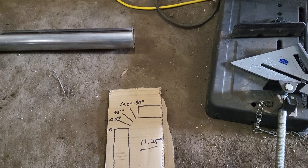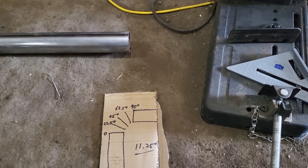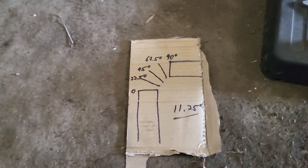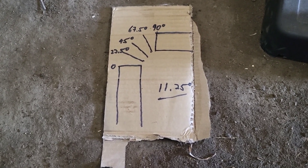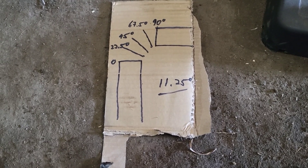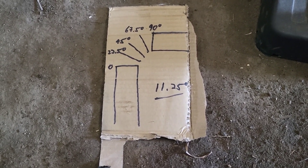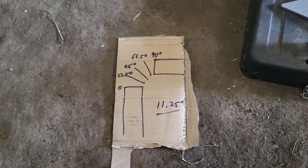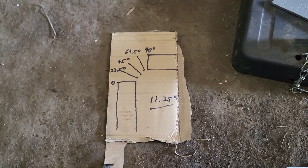I did get this from a video that Finnegan put out at some point. Initially you have to do some calculating. I want to get to a 90 degree bend, and I'd also like to easily do a 45. The best way to do that is with four pieces — two pieces gives you 45 degrees and four pieces gives you 90. There are cases where guys TIG welding turbo kits make very fancy setups with multiple pie cuts at all kinds of various degrees.